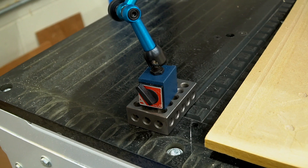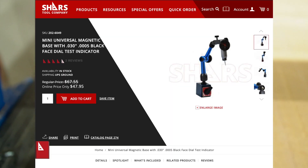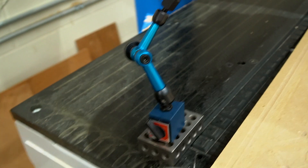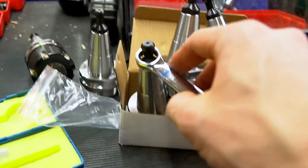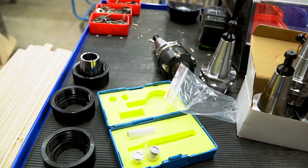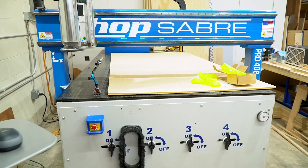This is just the Shars tenth gauge — this whole setup was like $60, I think. It's really worth it. If you're going to buy cheap tools, you might as well have something to verify that they're cheap. Make sure you tighten the pull studs when you get them — put them in your vise and tighten those babies, because they usually come loose. You don't want that going up into your changer. If you have an ISO 30 spindle, this is a great option.